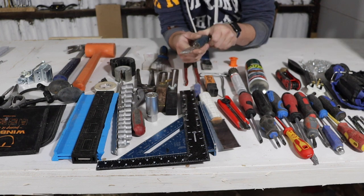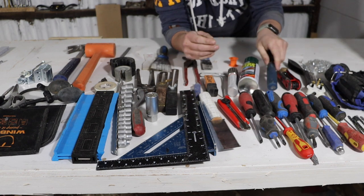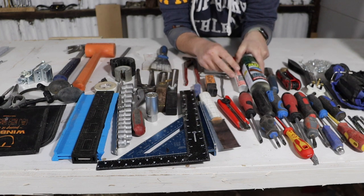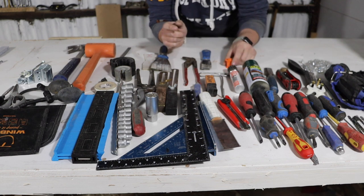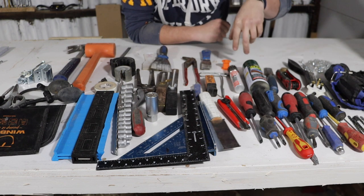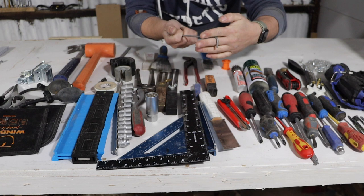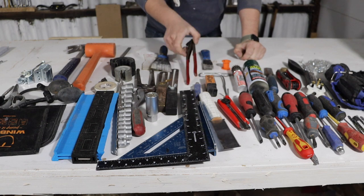A bashing chisel — just one I've abused, which I shouldn't really because it's actually a really nice old Stanley one. I've also got my Mitre Bond activator — I've normally got the glue in here as well but I've lost the lid so that's in the back of the van. There's normally two space plugs but I had to use one the other day, so I'll keep two on me — I've got more in the van. This is a little tool I made myself from a bit of bar — you put it in behind your plinth and pull your plinths off on kitchens.